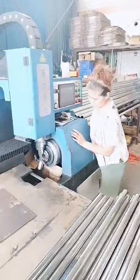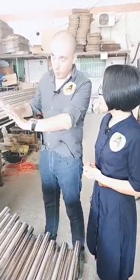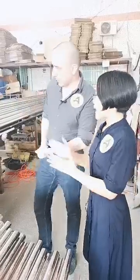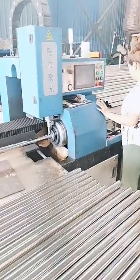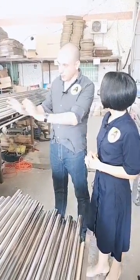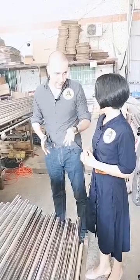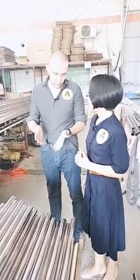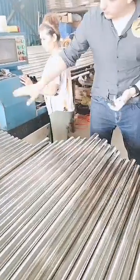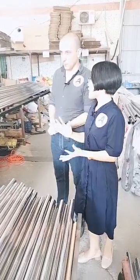If a customer buys this machine, is it going to be in a wooden box, or something I need to install when I receive it in my workshop? Yes, we will pack the machine with films and also with a plywood export wooden box. Okay, and I just install it, connect wires to 380 volts, 3-phase 4 wires, same as in China, 50 hertz, program it in Russian for example, set up settings for which tube I want, install the clamp. That's it. Yes, it's kind of installation free.